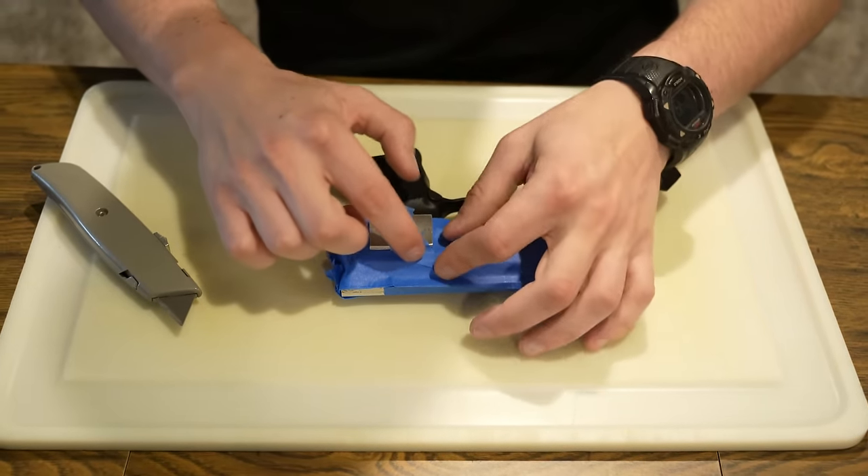It's important to make sure there's no large debris on the foam — big chunks of plastic will show up in your mold. Keep these clean. Setup height matters too: not too high so you're reaching up to compress it, and not too low so you're bent over and can't get the clamps on. Once the hot plastic goes in, I press it down and put my clamps on — this keeps it compressed for 10 minutes. Two clamps, one on each corner. And this is just a run-of-the-mill toaster oven.